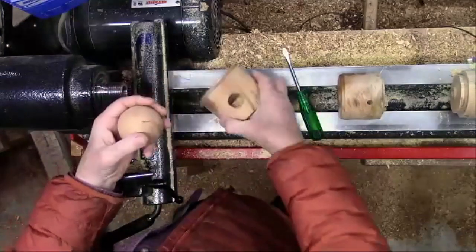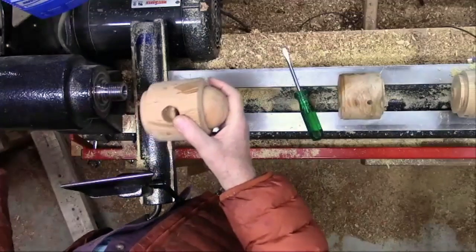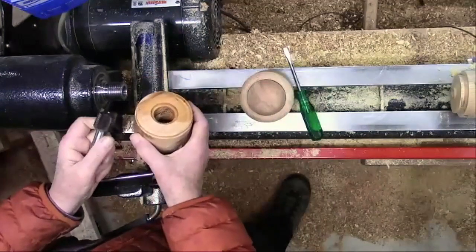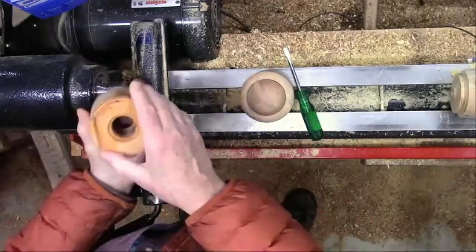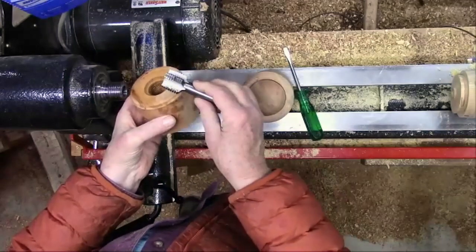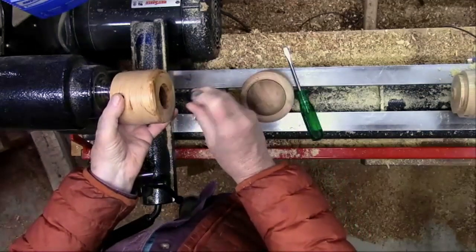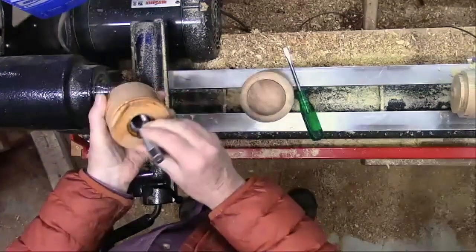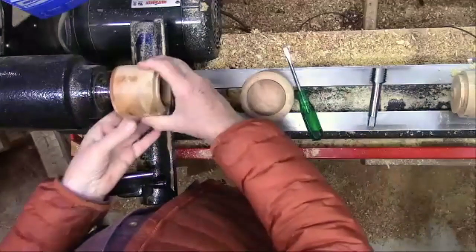A better way would be to make a tapered ramrod to push the ball out. The other chuck I made - I do have one of these one-and-a-quarter taps. This is a side grain block of cherry: I bored a one-and-an-eighth hole and tapped it with a Beall one-and-a-quarter tap. The tap has a little divot in the back so the tailstock can come right up into that - you simultaneously turn the tap with a wrench while you advance the tailstock, keeping the tap running true. Squirt mineral oil in there, and it made a nice thread that screws nicely onto the headstock.